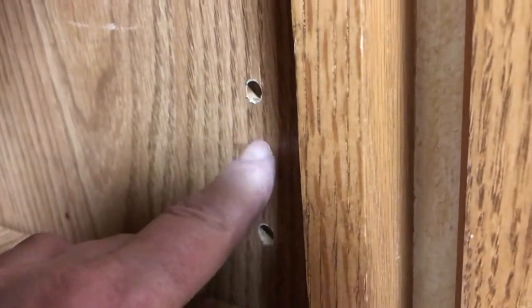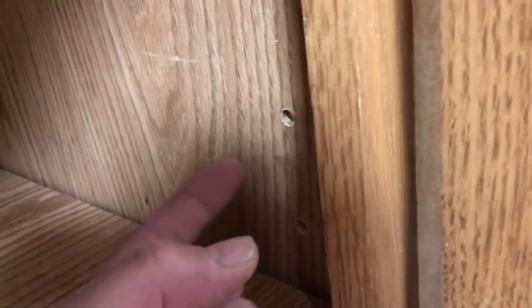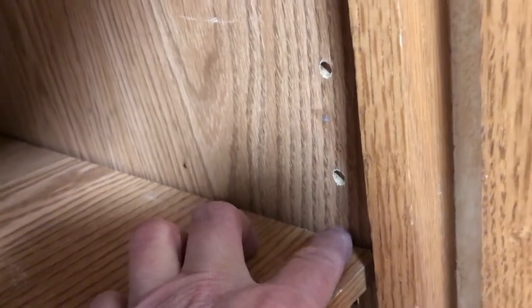I don't put a lot of weight on this shelf anyway. Basically you just screw them in — but don't screw them in where the hole is, because if you screw into the existing hole you don't have as much support. What I did is measure them all to the top and screw them in there. You could flip them around and have them hang upside down, but depending on how much space you have it might catch on the screw. Also, if you flip them and the weight is on the bottom, it might pull the screw out, so I figured it was better with them on top.